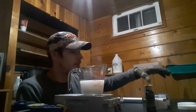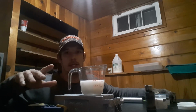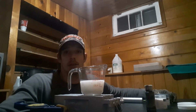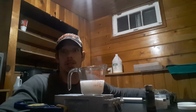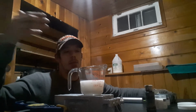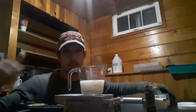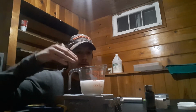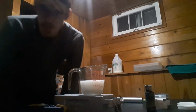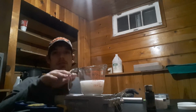Next thing, you want to figure out a plastic recipe. Now, you can go buy straight plastic. There's a floating plastic, there's sinking plastic, there's saltwater plastics, there's different mixtures of plastics for different strengths, flexibilities, and durabilities. What I do with mine, for the grubs and grubs only, is take a floating plastic, which is just your original plastic. For every 4 ounces, I add, was it 1 ounce? Yeah, 1 ounce of softener, I believe. No, I'm sorry, ½ ounce of softener for every 4 ounces.